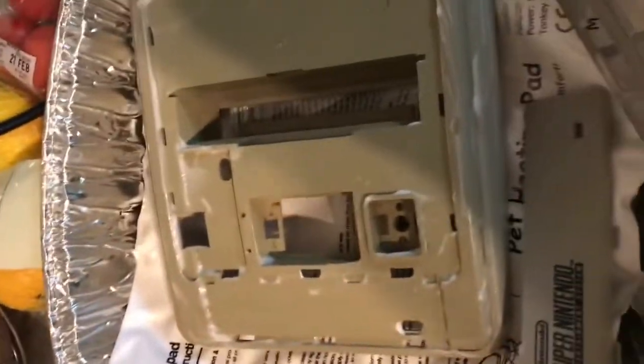As I showed you earlier, I now place all the plastic parts on a PET heating pad I bought from China. This is to speed up the retrobright process, as I believe heat actually helps the process along. I then cover everything with cling film or a plastic bag just to stop the peroxide from evaporating too quickly.